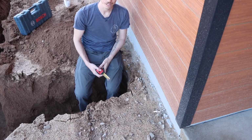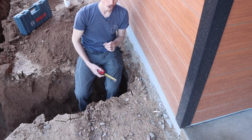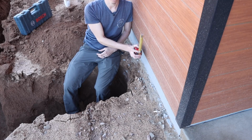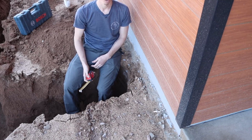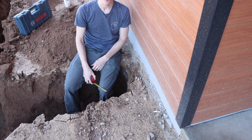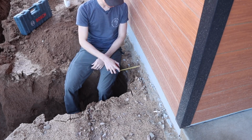Now, say I was working for an electrical contractor, what I would do if we had a good hydraulic bender is run my pipe right up here, and I'd probably do a little offset and then get my pipe up to the right level where I want it up against the wall here. Hydraulic benders are mucho dinero, and it's not something that you'd want to purchase for one bend. You're definitely not bending 2-inch rigid by hand. That ain't going to happen. Even bending 1.25" EMT is one heck of a struggle. So 2-inch rigid, no chance that you're going to bend it by hand.